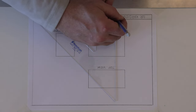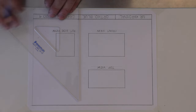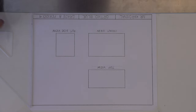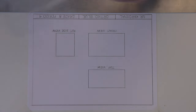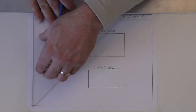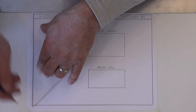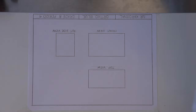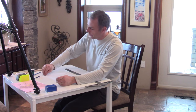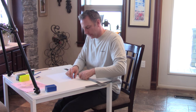All line weights for the border and title block should be fairly consistent. If your pencil gets too dark, sharpen and redull it to match. You'll need to flip your set square for some verticals — just wipe the edge and make sure you don't wipe your fingers on your draft. When rolling off your tape, remember to roll it away from your draft and throw the tape out — it gets dirty.